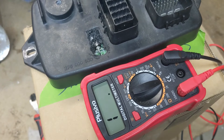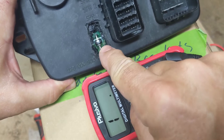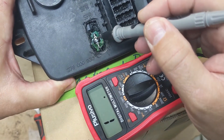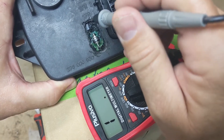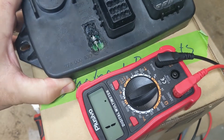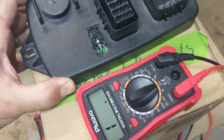So that's it — that is how you replace the diode. One thing I meant to mention: make sure you orient your diode in the right direction. That's a really important part. If you see this little line here, that little line needs to correspond with what you have on your motherboard — they match up, so the line needs to go towards the top on this one. The next thing we're going to do is put it in the ski and make sure it runs. Then I'm going to entomb this in RTV black silicone.